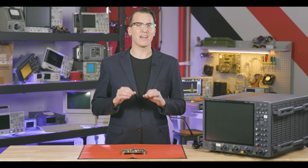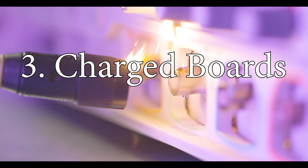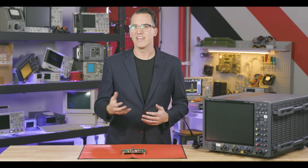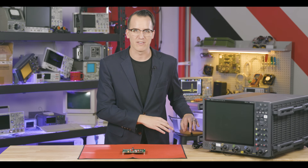I should also point out that it only takes a couple hundred volts to damage some gear, but you will only feel it when you're well above 1kV. The next few tips might be new to you and are all related to static field induction. If you aren't careful, your boards can charge up via induction and then zap your gear. Take, for example, this cart — it's pretty common for folks to need extra bench space and put boards and gear on an insulated material like this.